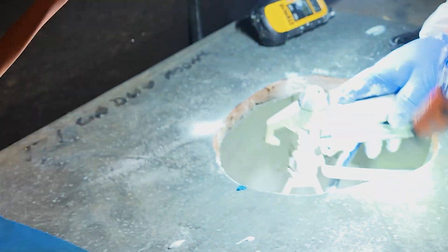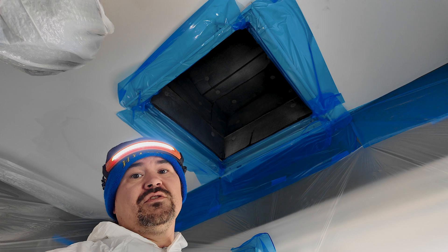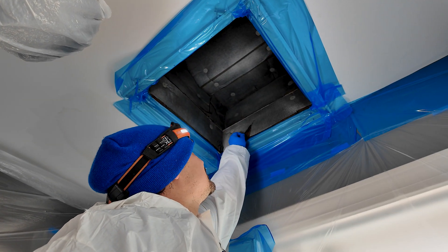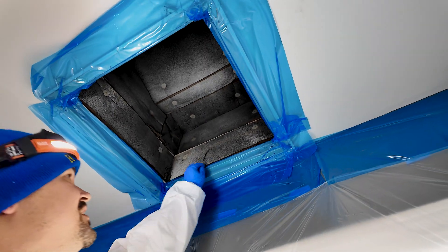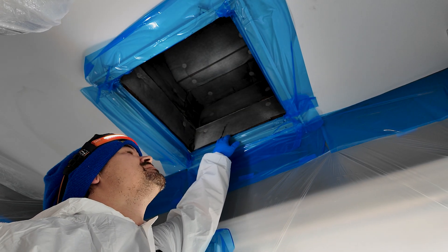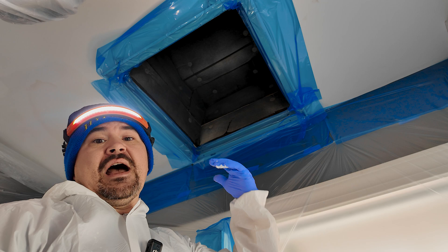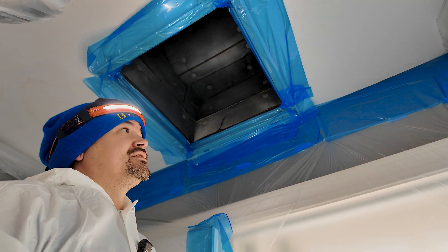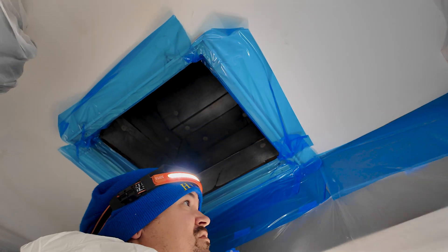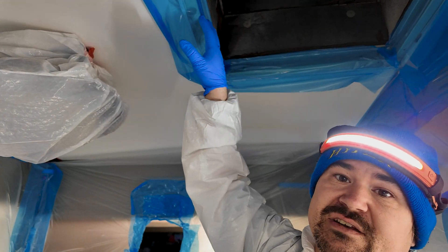You can get a picture in there — everything's white now where it used to be black. We're at the point of encapsulating the return drop, which is actually in the attic. You can see how the insulation starts to delaminate — this stuff is pulling into the air of the house and making people itchy and coughing. It's really expensive to replace because it's all riveted in. In my opinion, encapsulation is the right call — it'll last a lot longer and we give a 10-year warranty on the encapsulant. We also have the coil blocked off and taped — we're going to encapsulate that too.